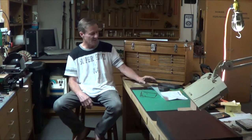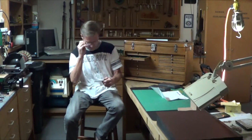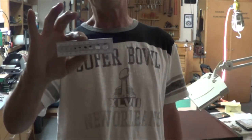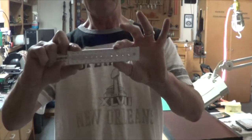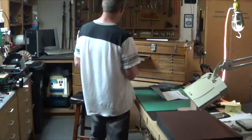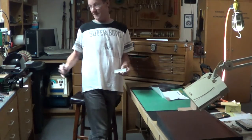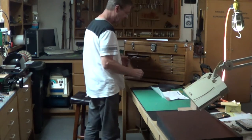I got to use it today. I was making another — this guy, actually. I was saying yesterday that I got the metric one because I couldn't find one, so I'm going to bring that up so you guys can see it. Here it is, upside right. That's the metric machine screw thread checker that I did. And I made today the SAE one. This is nice and thick. I love it. I've already put some screws in there to test it and it's beautiful. I've got both of those, and I used the micrometer to make sure both of them were the same size, because I couldn't get the caliper in near the end mill where the chuck was — everything was blocking it. So I used the micrometer. It works perfectly.